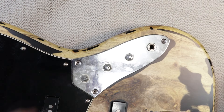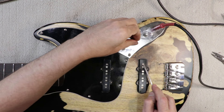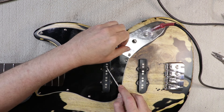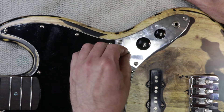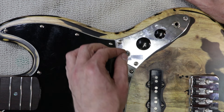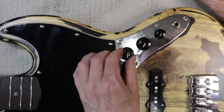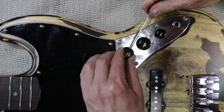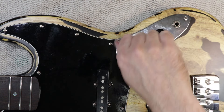I'm running a copper tab up to all three control plate screws. I'm also putting a little piece of guitar pick or something between the two halves of the split shaft, because even with those brass adapter bushings that take your 6mm shaft out to quarter inch, I like to pack out the split shaft — the grub screw on the knob is still likely to crush and break the shaft otherwise.